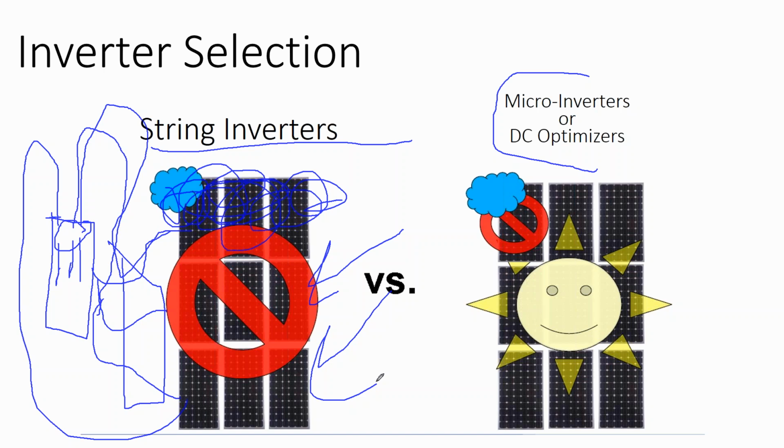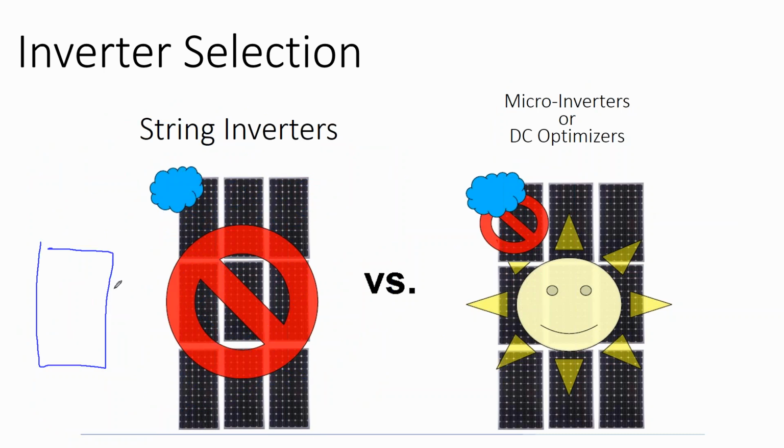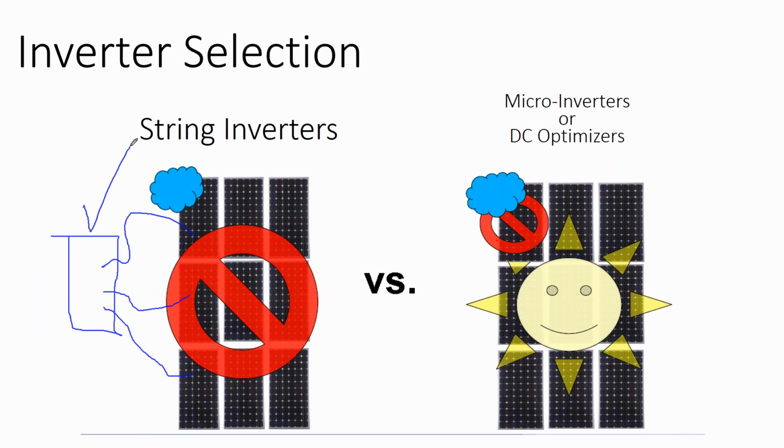5 years ago, a small amount, just one little shadow on one module could throw your whole system into haywire. But now your string inverters will often have 1, 2, or 3 circuits that they can track independently to provide some degree of mitigation. And so at that point, what you would do is you'd land all 3 circuits in a junction box, and then that junction box would take care of your rapid shutdown. And then instead of combining, your 3 circuits would go straight through and land on your inverter, where they're individually managed by the inverter. And that means there's 3 times as much stuff on the DC side of that inverter than there used to be.